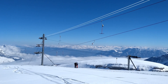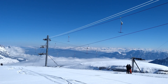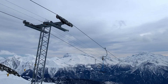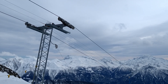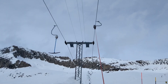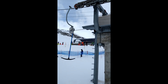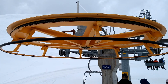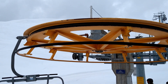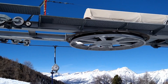In my very first Mighty Machines video, I had explained various ingenious ways to overcome what I call the impossible ski lift problem — building a ski lift that has both left and right turns. In order to deflect the lift's steel rope, or cable for Americans, into a specific direction, a pulley must be placed on that side of the rope. This means that you cannot attach the T-bar's grip there, as it would crash against the pulley. The grip can only be on the outer side of the turn. For this reason, it is quite a challenge to build a ski lift that is able to deflect the rope both clockwise and anticlockwise. In my video 'The Impossible Ski Lift', I have shown three solutions to this problem.